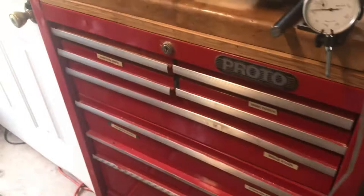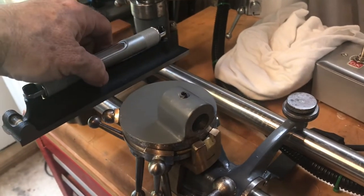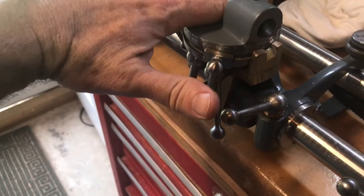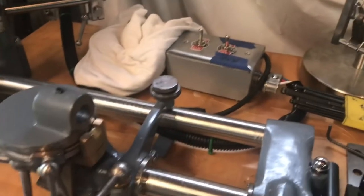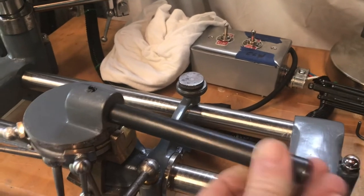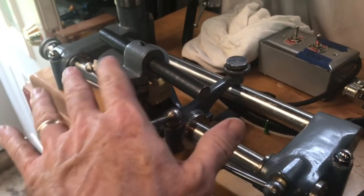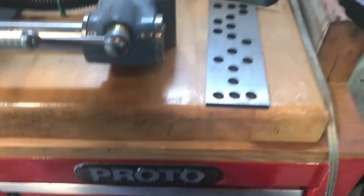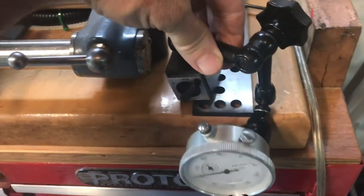For this particular instance, I've got some machinist levels. The first thing I did was to use the machinist level and set it basically parallel with the bars. They don't talk about doing that in the book, but I thought it would be a good first step to make sure this thing is essentially on the same plane as the two bars before you start the turnaround test. I've been fiddling around with this for about a half hour and got it within a couple of thou on either side — basically tramming this using the Noga indicator. These little Noga indicators are great, I use them all the time now.